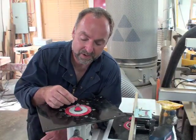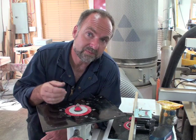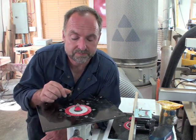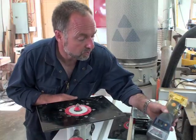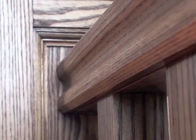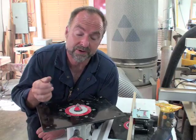The next kind of bit I want to tell you about is the 45-degree chamfer bit, which might not seem very fancy until you realize how versatile it is. Regular ones of this size I often use in small handheld routers to put really tiny chamfers on otherwise square-edged projects. It makes them look crisp and neat and helps those edges to withstand bumps and bangs better.